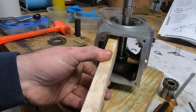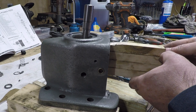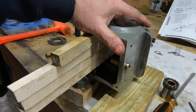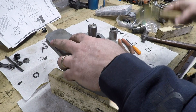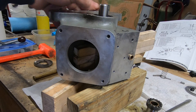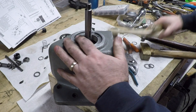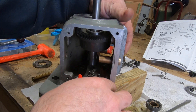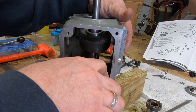So now I'm thinking maybe I can use this hub to my advantage. I disassembled the hub completely and took out the clutch, so it's just the hub and the spiral gear. I figured if I can push that on top of the bearing, that's a little sturdier and jams up next to it, but leaves me some space for the shaft, then maybe I can tap the shaft through and the bearing won't move. They do say the third time is the charm — and I was happy to see that actually worked. With the shaft happily in place, next will be to install the snap ring and thrust bearing.